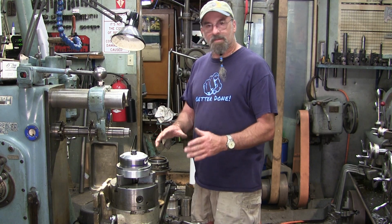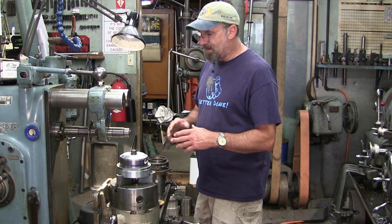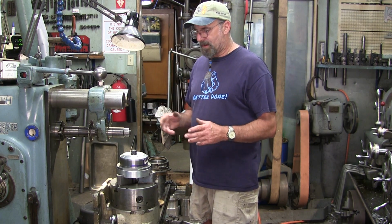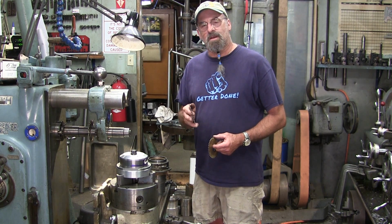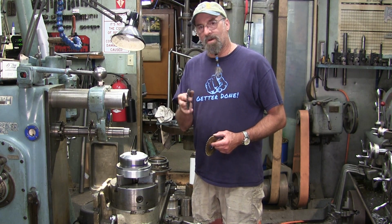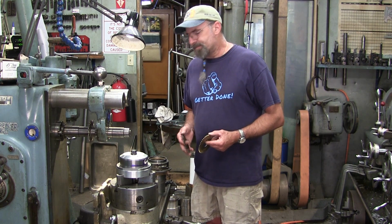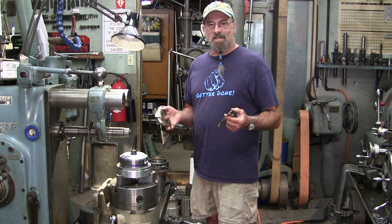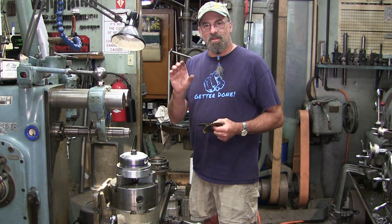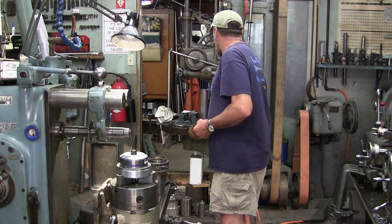So what I'm going to do is take the dividing head and mount it square on the table, then slide off our overarm, and I think we're going to set up the stagger tooth cutter. Even though this is about 150 on the width and this is 1/8, our actual slot is about 100 thousandths, but we know what the slot's for. It's just for clearance so that when you tension down on the drawbar,